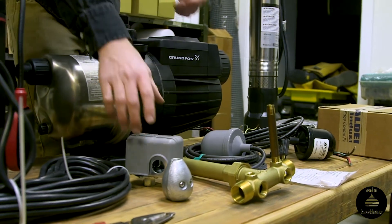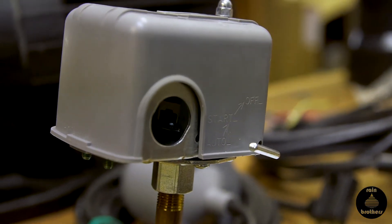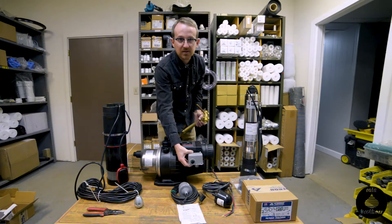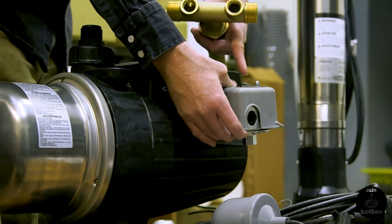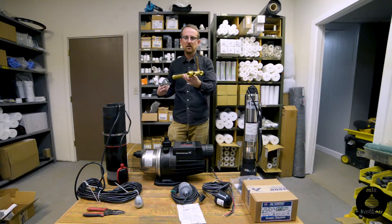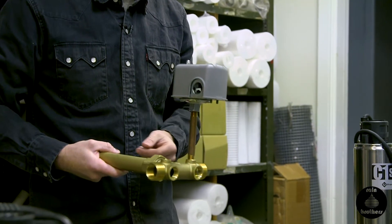The second method for protecting your pump: if you have a jet pump, you'll likely have a pressure switch. Usually the pressure switch is either wired directly into the pump — such as a Goulds, Xylem, or Franklin pump — or you may have a pressure switch in your pressure tank, in which case it will be mounted to a tank tee like this. The pressure switch threads into the tank tee and this is what controls the on/off function of your pump.